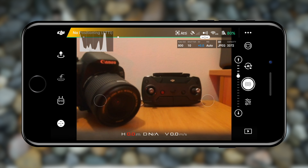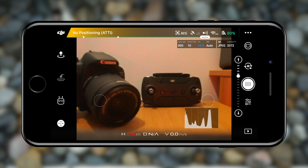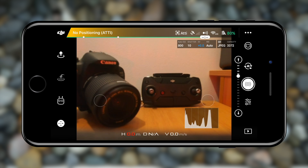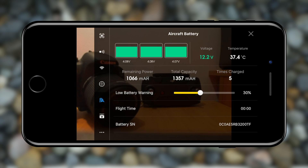At the top of the screen you see the current flight mode and information. Right now we're indoors so there's no GPS lock and it shows a yellow warning. Once outside you'll have GPS lock and it will turn green saying 'good to fly.' Underneath is a small green battery bar — as you fly it moves left, reaching the first dot at 30% and the second dot at 10%, at which point you should land immediately. To the right you can see the number of satellites connected, the Wi-Fi signal strength and channel, and the battery level percentage, which when clicked takes you directly to battery settings.